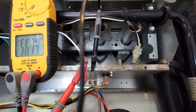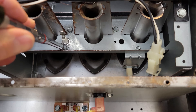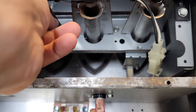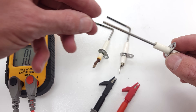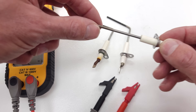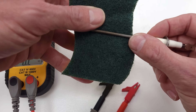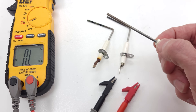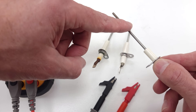With the power off, we can remove and inspect the flame rod. After removal, you can see they typically don't go bad — it's just a stainless steel rod with a ceramic collar. You want to clean it off with non-soaked fine-grit steel wool or a Brillo pad. You want fine grit so you don't leave scarring that would allow carbon dust to accumulate. Removing any soot is important because it impedes the electrical current flow from the rod to the flame.